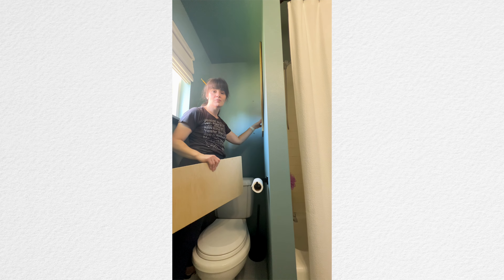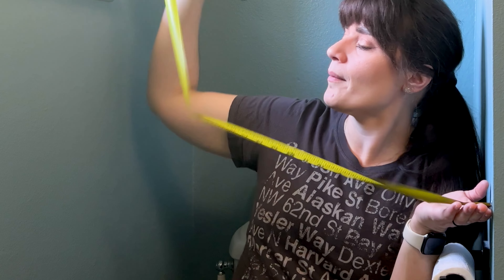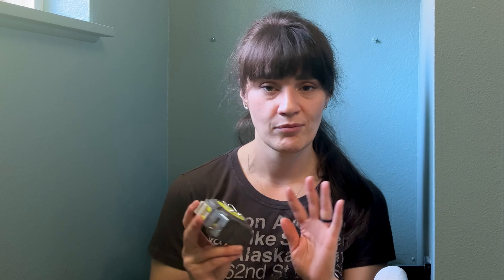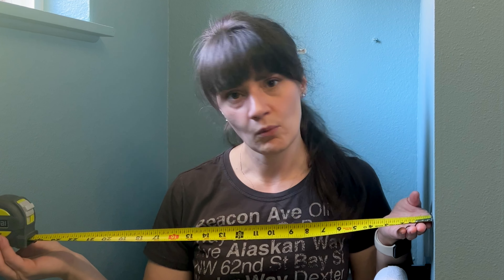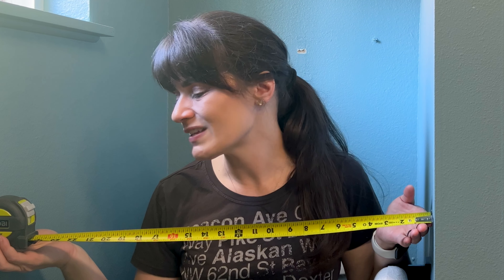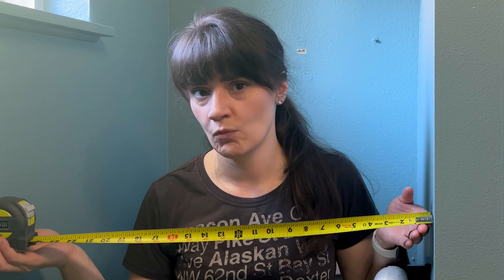Oh no. Actually, I should have plenty of wood. I completely forgot to do something so simple, and it threw off all my math. Here's what you do: instead of bending the tape measure and trying to cram it into the edge — that never works — every single tape measure in the US, and probably internationally, has it printed on the back how wide the tape measure holder is. This one's three inches. So all you have to do is match this end with the wall, read your tape measure. This one says 24 and a quarter inches, and then I'm just going to add three inches to that, which makes it 27 and a quarter inches. I just forgot to add the three inches.